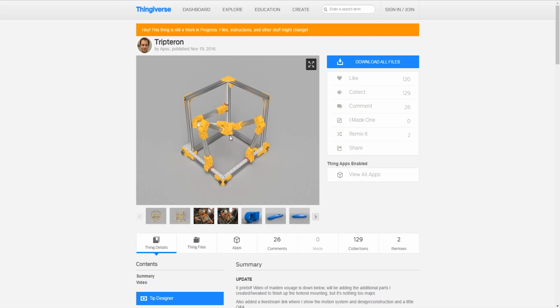So you don't need any sort of, for example, on a delta, the arms are angular, and the XYZ coordinates are done by changing angles, because all of the motors are parallel to each other on the same plane, but obviously rotated around a circle. So your G code is submitted to the controller in XYZ Cartesian coordinates, and then the controller has to convert on the fly from XYZ coordinates to angles to Y or Z movements on the motors, and then drive those steps.